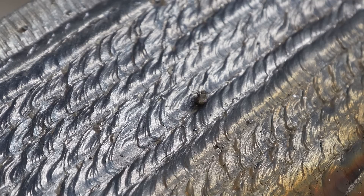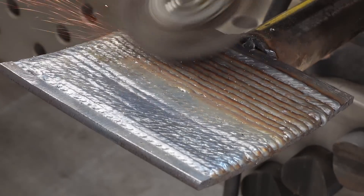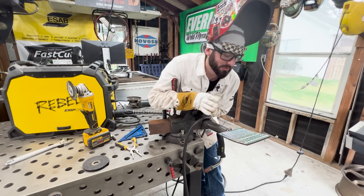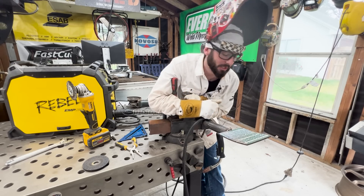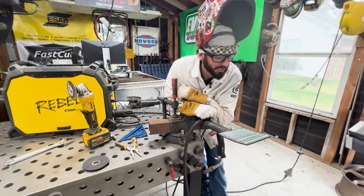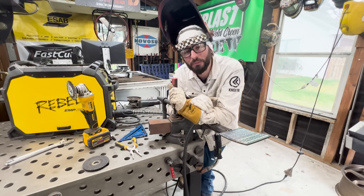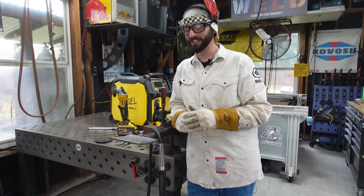Once you've made it from one end of the plate to the other, give everything a good jimmy and inspect those welds thoroughly. Your instructor will probably want you to keep welding — it's all practice and procedure. If you want a nice flat smooth pad weld, you've got to weld over something nice, smooth, and flat — so if you have high spots, grind them down; if you have a low spot, fill in that valley, then go in the opposite direction of your prior beads. I have some happy little accidents myself — some of my beads are a little cattywampus — but the goal is just to be better every single time.